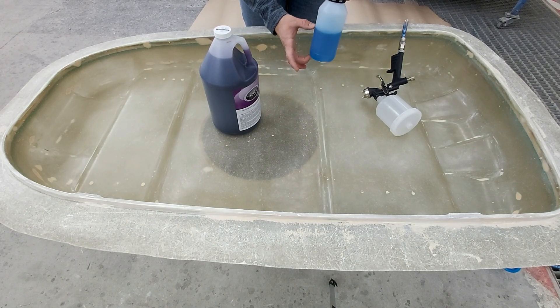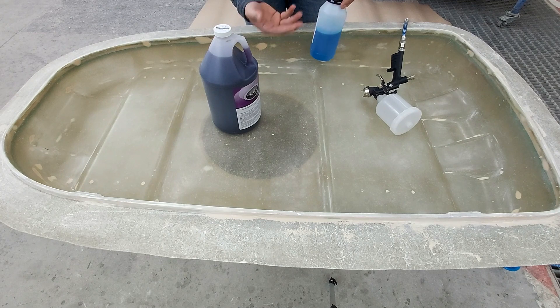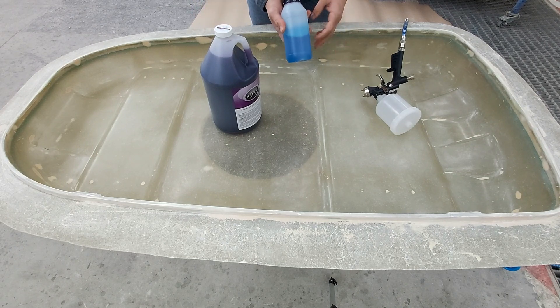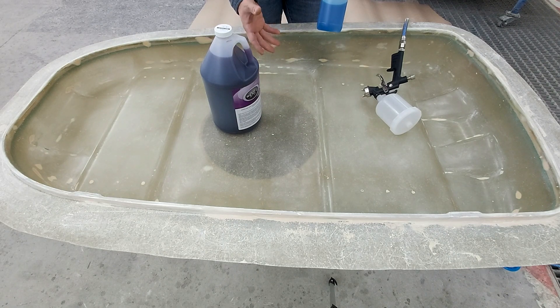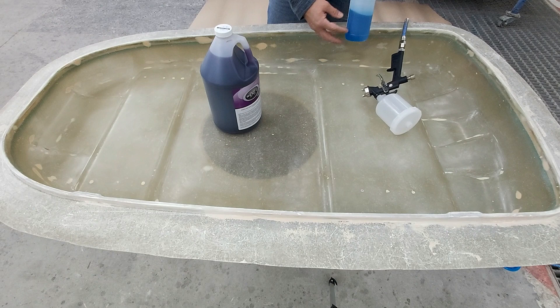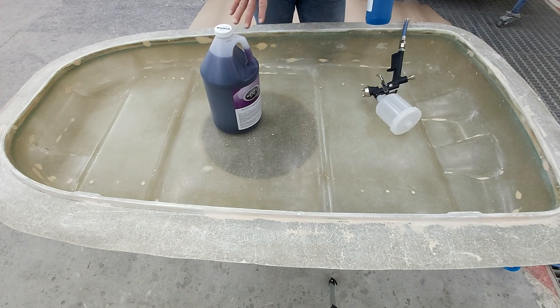This is what was remaining from the Turkish one. I'm not going to use it because I don't want to combine them — even if they are the same substance, I prefer not to mix brands. Today I will use only the Lexco one. My rule is to apply a minimum of three layers, but very thin ones. Some colleagues apply until the mold turns the same color as the polyvinyl alcohol — blue or purple — but I'm not going to do that, and I'll explain why.